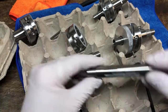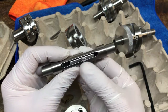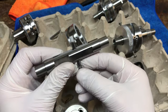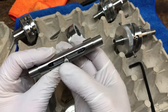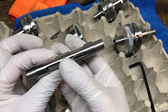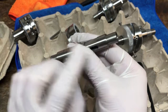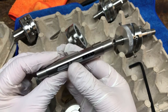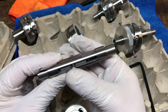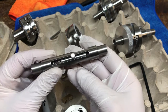So the way this works — this is an assembled shaft. Inside is the spring carrier, and there's a spring on each end. This isn't locked in, but just to show you, there's a little bit of play — about half an inch of play. At each end of travel there are set screws that are adjustable. Basically when this is moved, it loads the spring in this direction, and then firing the other way, the spring gets loaded in that direction for the return fire.